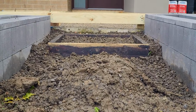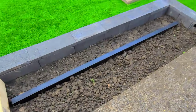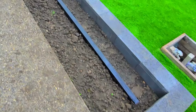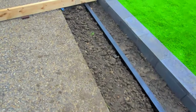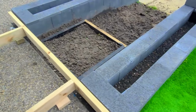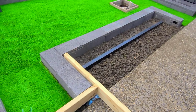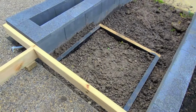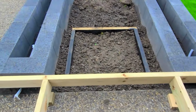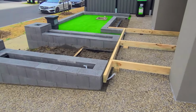So now it's almost raining, and now I will start my work, but tomorrow I will just extend the frame till that point. So this is also done, but please don't forget to apply the waterproofing. As you can see, I just applied the waterproofing because it will be in the soil all the time. The waterproofing is a good option. And maybe I also install some moisture barrier between sleeper and my deck joists to protect my deck's frame. So that's all for today. It's raining now. We'll work tomorrow.